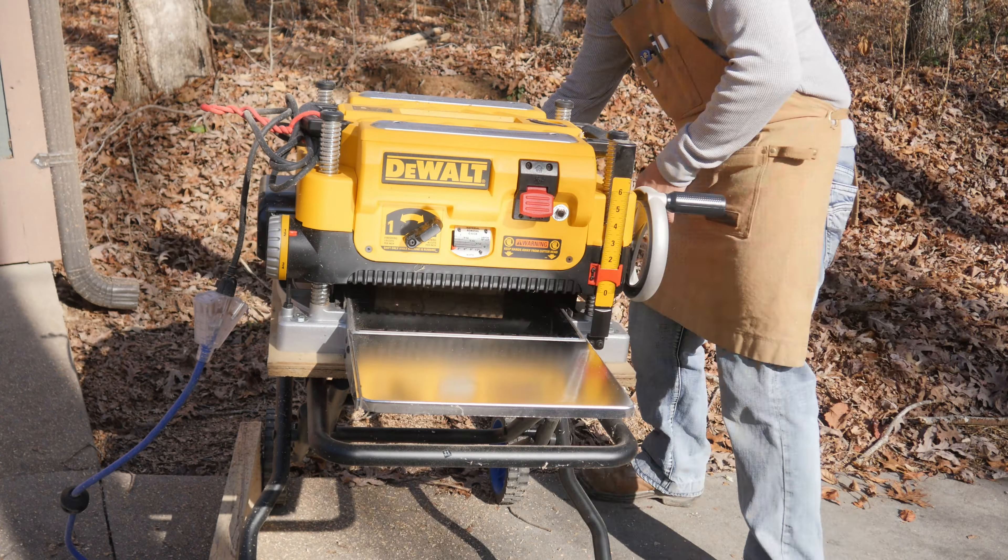I finished planing these — look how beautiful that wood looks. For the cutting board, rather than using the face grain, I'm actually going to use the edge grain. I should be able to get this same pattern in all of the edge grain, and doing that lets me conserve more of the wood and not have to plane so much of it. Pecan is really hard — it's like hickory — so it's really tearing up the blades on my planer if I keep trying to plane it down further.